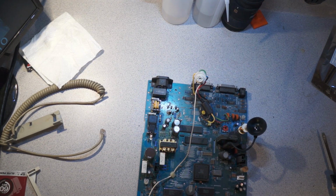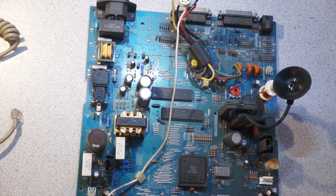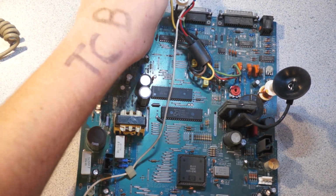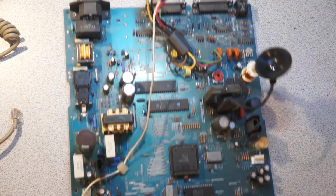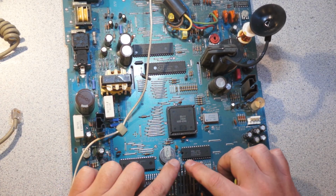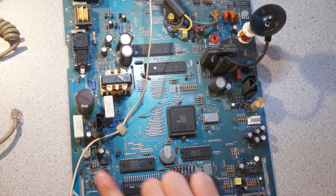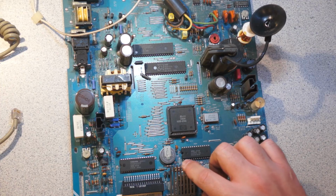This is considerably more Spartan than the other terminal I tore down. It's also considerably more dusty. But it's in pretty good shape, actually. So here's this interesting, I guess EMI control related thing. We just have a bunch of tines that push up against that copper strap, the implosion strap around the tube. That's kind of intriguing.